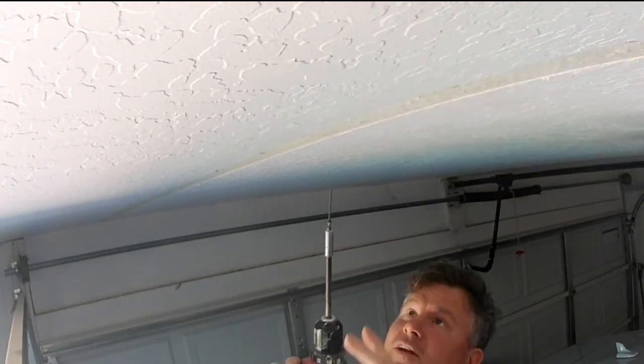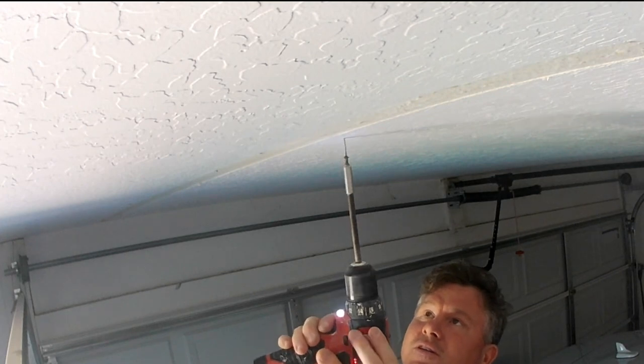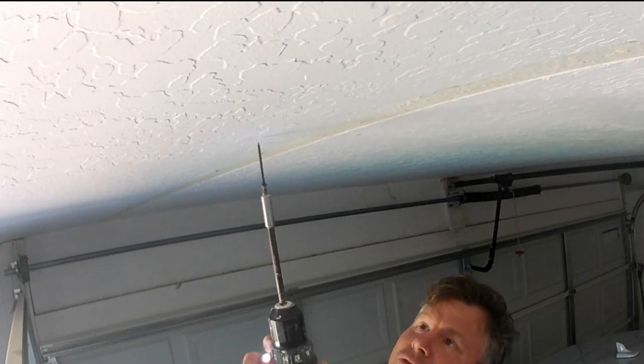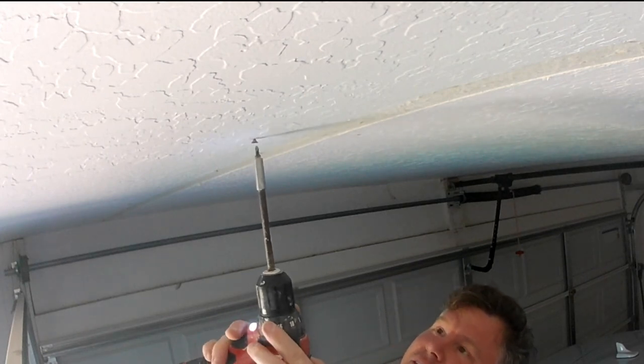I don't care what others say, whatever they're trying to push, this product or that product. More than likely, they're sponsored by a company just trying to push the newest gimmick out there. Just stick to a regular fiberglass mesh tape that you get at any home improvement store. It's there for a reason. But yeah, just get it all fiberglassed.